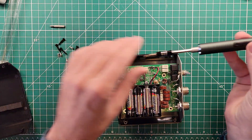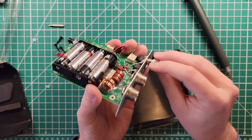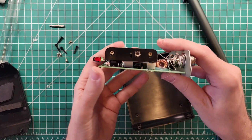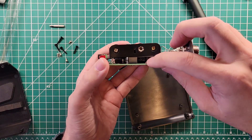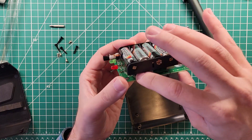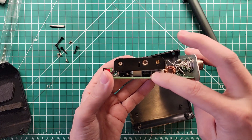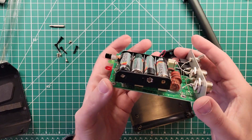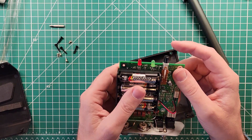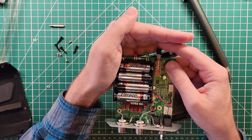I kind of forget that it's electric. We can take the front panel off, and the back panel would come off if we removed the nuts around the ground screws. What I wanted to do was get a good angle to see in there. So: toroid, relay, capacitor, relay, programming chip. Those capacitors are silver mica capacitors — those are like the bee's knees when it comes to doing RF work. You can see the tune button light up and try, but there's nothing to tune so it's not going to work.